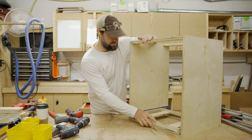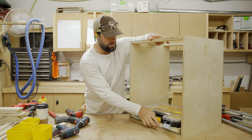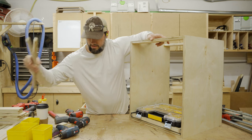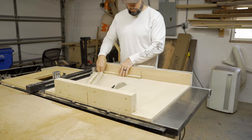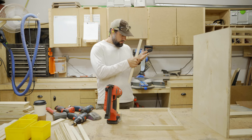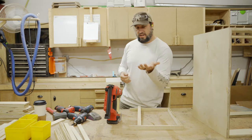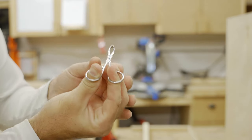This is why I do one first — it's just a little too tight. It'll work if we slam them, but I'd like them a little loose. We'll take all our trim pieces — all 14 of these — and take just a tiny little bit off, and I think we'll be good to go. That splinter right at the crease of the base of my pinky is an incentive to switch my table saw blades when cutting plywood to reduce tear-out.